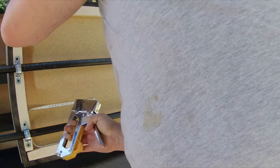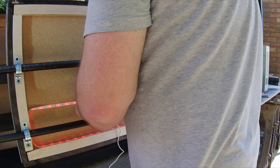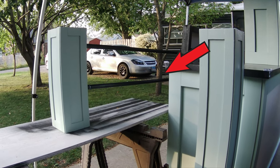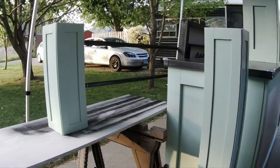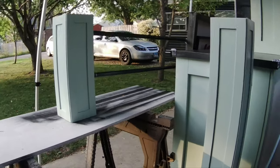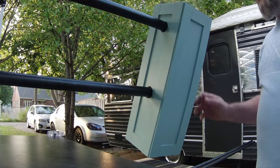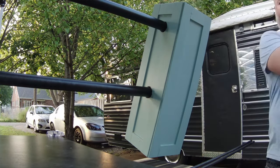I gave everything a test — all the lights worked, everything seemed good to go. But as I went into the garage to start building a lid holder, I turned around and noticed the problem the three-quarter inch conduit would give us: the sign was sagging a lot. Spanning about ten feet, the three-quarter inch conduit was just too much to hold it straight. I thought about leaving it but decided no — I switched to one-inch conduit, which was definitely the right move: it stayed very straight, was very stable, and there was no risk of it coming down on anybody's head.